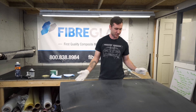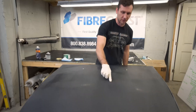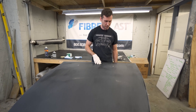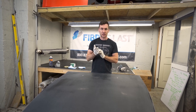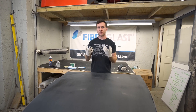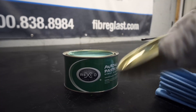We're going to remake Xavier's S2000 hood. It's a fairly easy part, it's pretty flat. What I've done so far is just sanded the whole top with thousand grit - there were some little dirt nubs in the paint and other small stuff. We're going to make the outside shell of it: four layers of carbon fiber, 3K 2x2 twill. Then we're going to cut the skin off and use the bottom section of the actual aluminum hood and bond that to the carbon fiber outer skin.